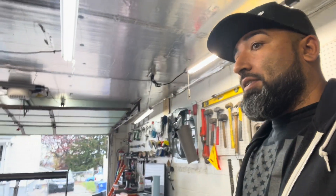I really don't care how this looks underneath. I'm going to put some bracing underneath later once we start to clean this up. So right now I'm just going to get out the air compressor, try to blow some of the extra dust off, let it dry out, and see how it looks. Then we'll probably mix up some more epoxy, do a thick layer over the whole thing, and see how it turns out. To get to the point where I'm at now, I cleaned the carbon with dishwashing liquid and water just to get all that dust off, then I took a heat gun and dried the crap out of this — probably spent about 40 minutes drying it. Right now I'm just trying to add a thick layer of resin across this, hopefully I have enough left.